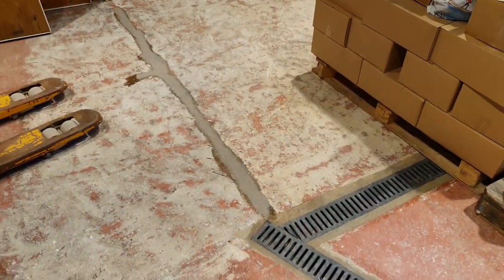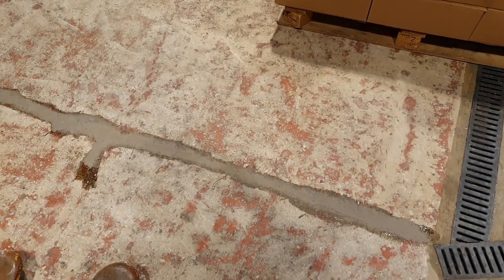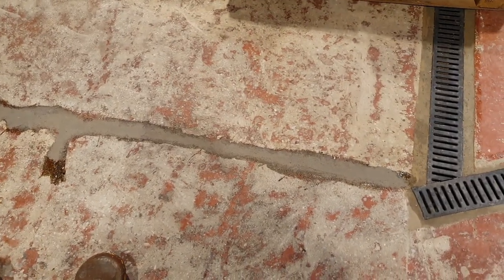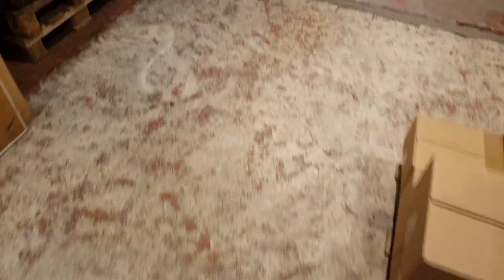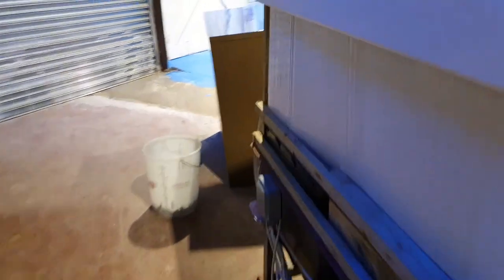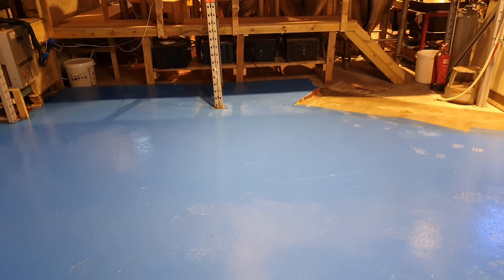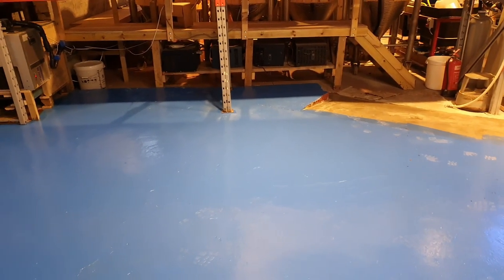I've spent all day doing this repair work - it took quite a long time to chip it all out with the SDS and then mixing this stuff up. You only want to mix about a kilo or two at a time just in case it goes off in the pot, so I was being quite cautious. I need to move this stuff tomorrow or the day after back up to the new painted area and the cask wash area. Look at the footprints already - it's all dusty. It's curing nicely but I can still feel that my fingernails would make a mark, and certainly the pallet truck is going to make a mark on there, so I'm definitely not going to be pulling any pallets up here just yet.